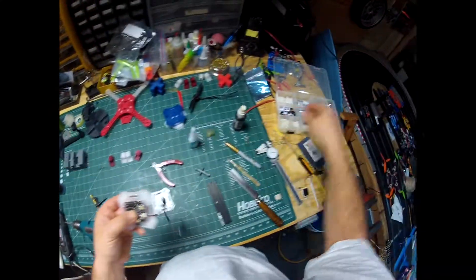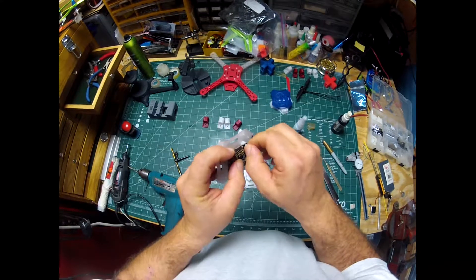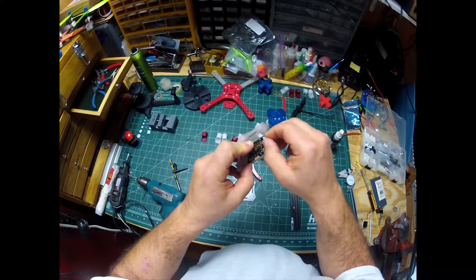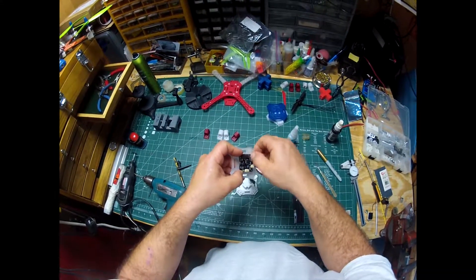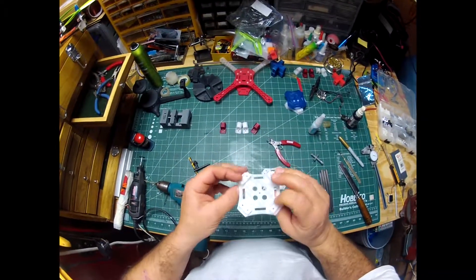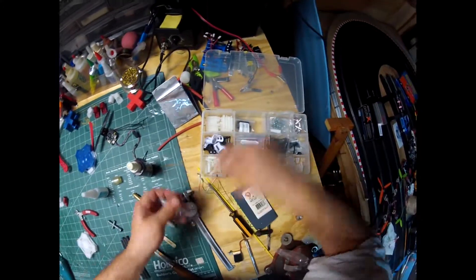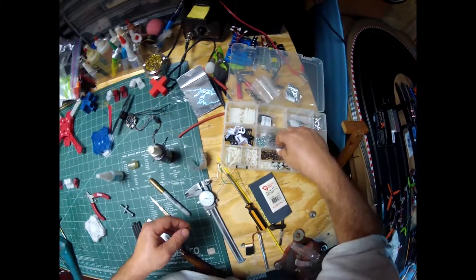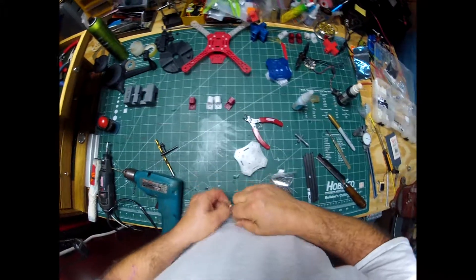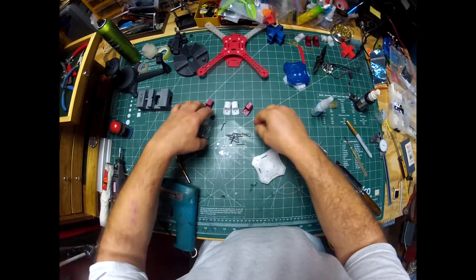This will take a standard flight controller right there, and this will get mounted over here like this, or wherever you want to put it. I'm just using nylon nuts, cut to size. That's a CC3D - CopterControl, OpenPilot. Haven't tried one of these yet for acrobatics, should work fine. I've been using the Pro Flip or the Flip 32 from WhiteSpy. Now we're going to set up our bolts. I'm using aluminum hardware - special ordered - to try and save weight, although regular steel 4-40 or 3mm will work fine.